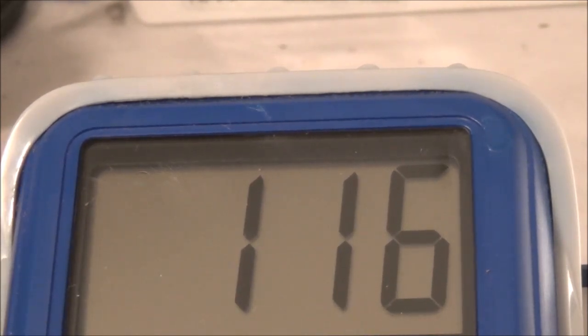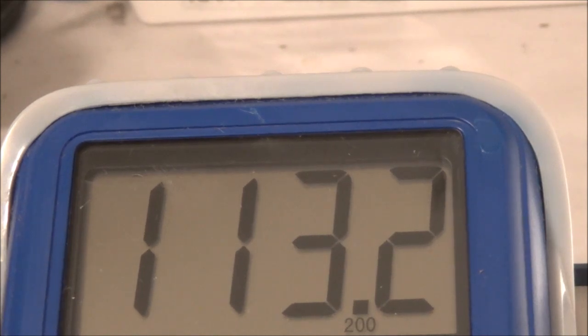So I would say for the age of this unit it's actually doing pretty good — 115 picofarads. These things do have a certain accuracy percentage; I think it's about 2.5 percent, plus or minus a digit or two. At the maximum setting, I've got 113 nanofarads, and the maximum is supposed to be 111 nanofarads. Again, this does have a few percent error. Checking with the Fluke multimeter it reads 113, which is close enough for what I'm doing.